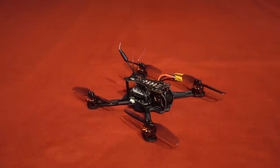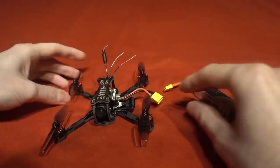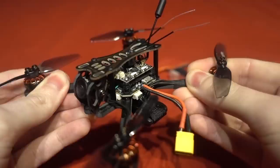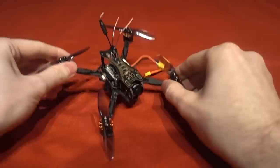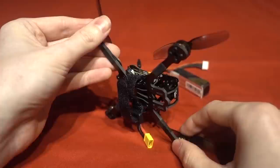When I first saw this package I thought the model was the same as the Novice 2, but it isn't. The Novice 2 uses two 1S lipos in series whereas this one is 3S and uses a single XT30 connector, which is better for current draw. I think the frame is the same — it bends very easily, it must be badly cut or poor quality carbon, because it's 3mm thick and shouldn't bend like this. Its dry weight is only 68 grams and with the included 450mAh 3S lipo it weighs 110 grams, so it would have to be a very heavy crash on concrete before something breaks, but you can buy the unibody as a spare part if it does.